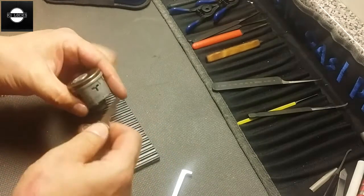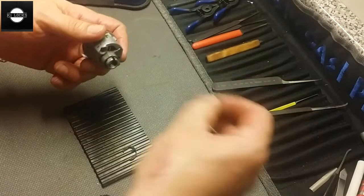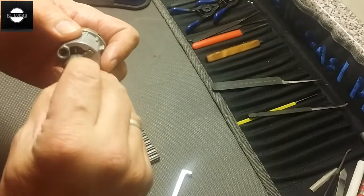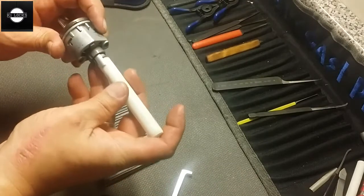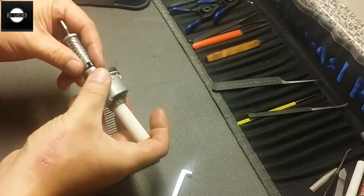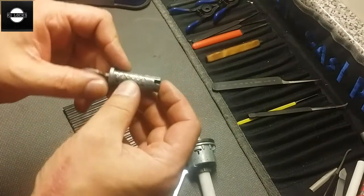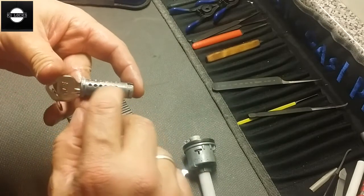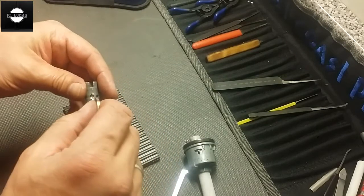Clip off. Key in. And I'm not sure what kind of madness he put in here, so I'm going to shim it. Always a safe bet. Plug follower here. And we have a 6-pin construction core, so normally there's probably no T-pins in here, but if there was, normally you would seal those up with epoxy, just in case. Because if something drops in there, then you're hooped.